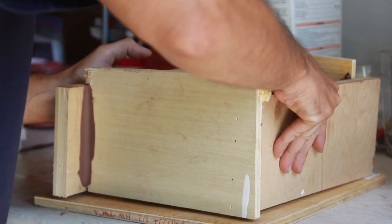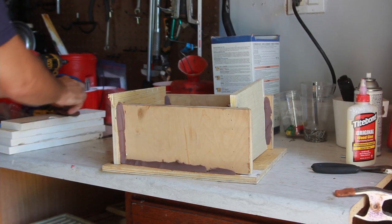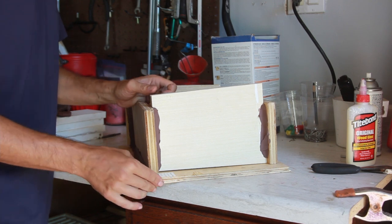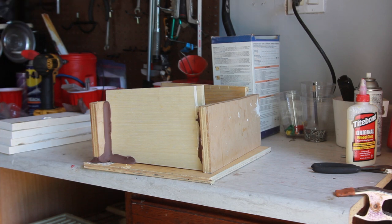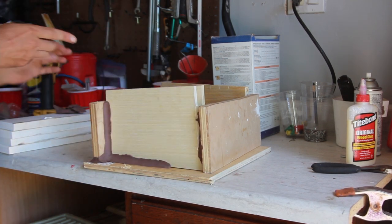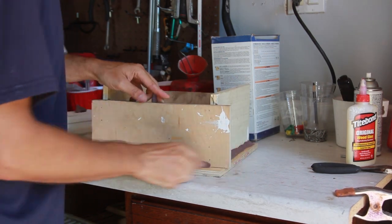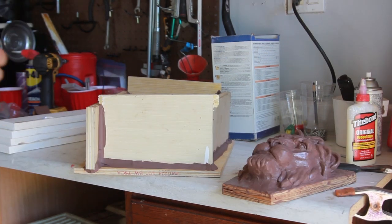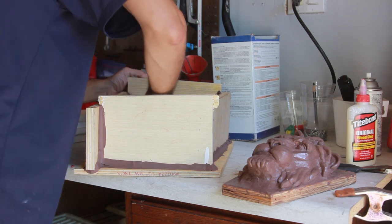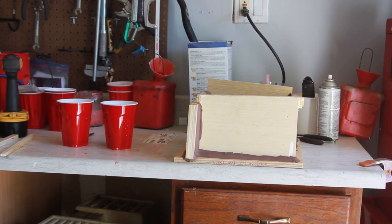Now I'm going to put the box. Make sure there's plenty of space on the sides, and I'm going to take more of the clay and put it around the outside. I removed the lion and I'm going to put clay on the inside corners and the edges. This is really going to stop the rubber from leaking out. The box is done.